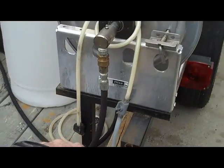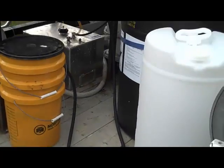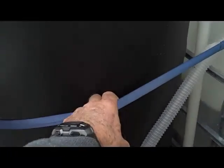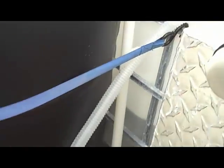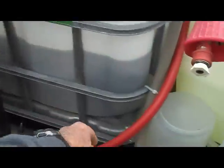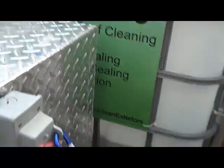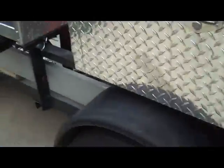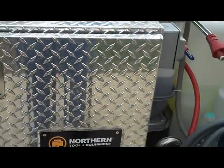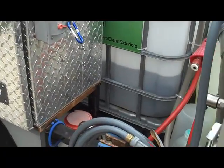My fabricator built a little bracket for my pressure washer. Get to be friends with a fabricator — you're going to need them. I'll strap things off, bleach off. See that bracket down there at the bottom holding my tote on? Just get some U-bolts — I've got two on each side, two in the front, two in the rear, and two on each side, bolted through the floor of your trailer. It holds it solid as rock. That way you're not riding around with straps that might dry rot in the weather.